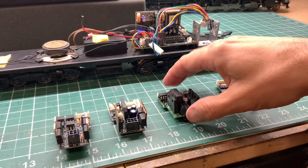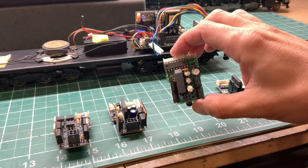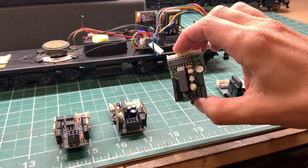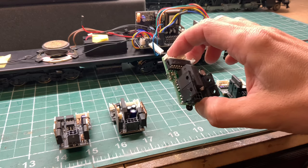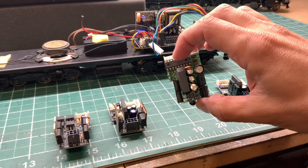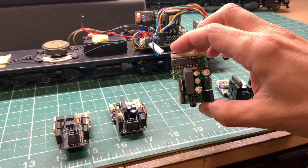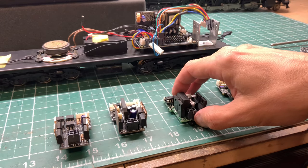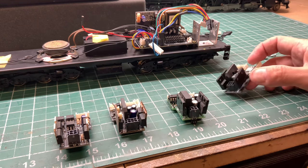And then moving on, one of the first big improvements for Lionel cruise control came from Train America Studios in aftermarket form. And this was their EOB, engineer on board, modular version. And this used their optical feedback sensor, and it was tunable, and you could have different cruise modes. You had 128 step, 32 step, and then you had cruise off. And cruise off, I think, used the PWM, and it was just 32 voltage steps based on pulse width modulation.